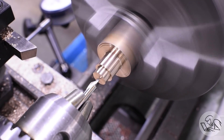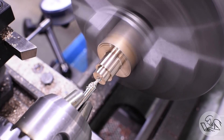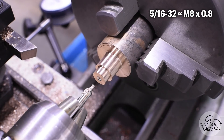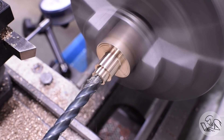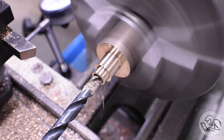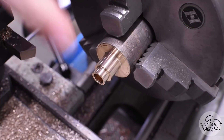Now we need a hole in the middle of this thing so it can do the job it's designed to do - create threads where normally there could be none. These top two steam valve bushings are 5/16-32, which is a bit of an unusual thread but fairly common in model engineering, so I've got the tapping drill size for that. I'm drilling deep enough for two of these bushings - I'm going to make both steam valve bushings kind of at the same time, but not exactly, as you'll see.